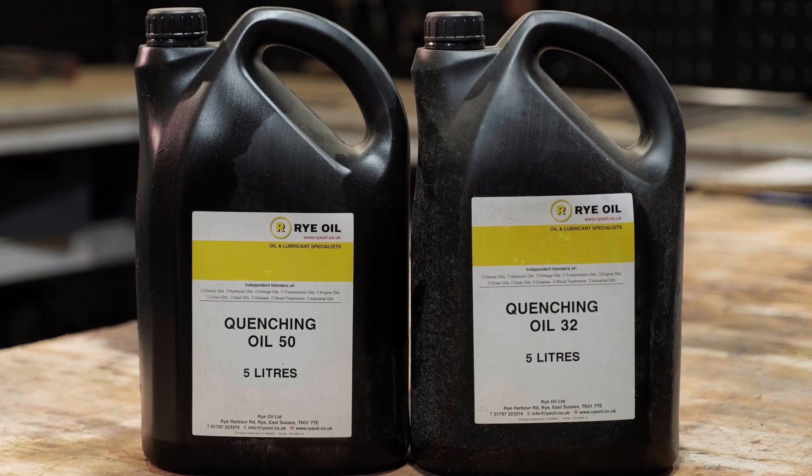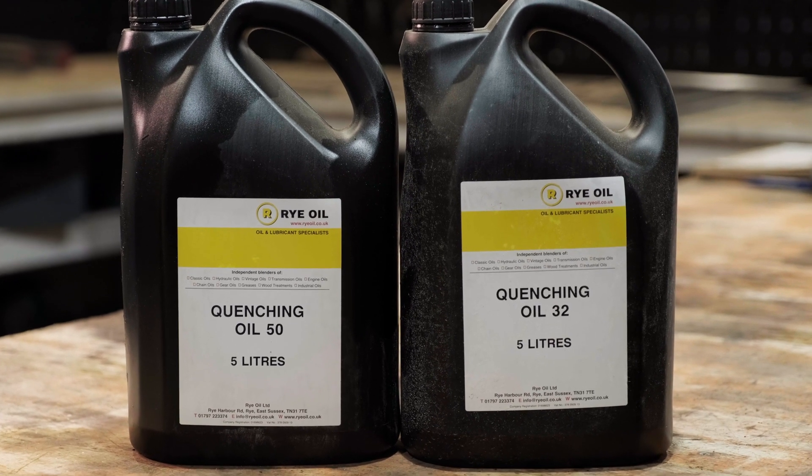Nearly all of them have got a critical point in the cooling. So you put it into the oil and that piece of steel starts quenching quite quickly because you've got the right grade of oil — it's ripping the heat out of that hot piece of metal. You've got a critical point that's around about 600 degrees, so we have a little curve. You can actually get a graph — a TTT diagram, a time-temperature transformation diagram.